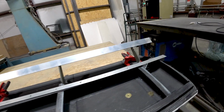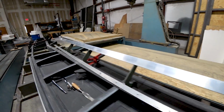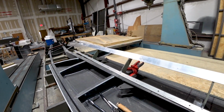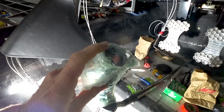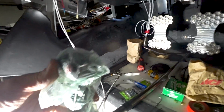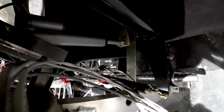They're aligned nicely, all in the same alignment, using that right angle aluminum channel, and bonding those into place. And back in the cabin now, the side sticks have these little hats on them that allow you to adjust trim on the elevator and the aileron. If you see there, I'm pushing on the trim switch, and you can see the linear actuator pulling in, and that's doing a nose up attitude. So that appears to be working from the side stick, which is neat.